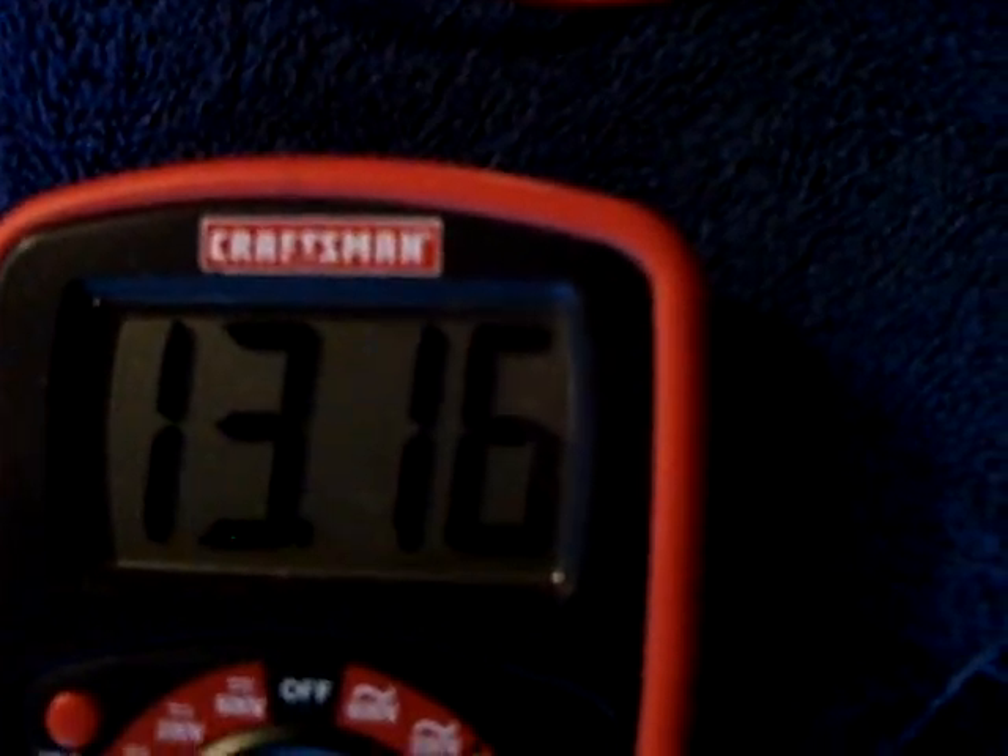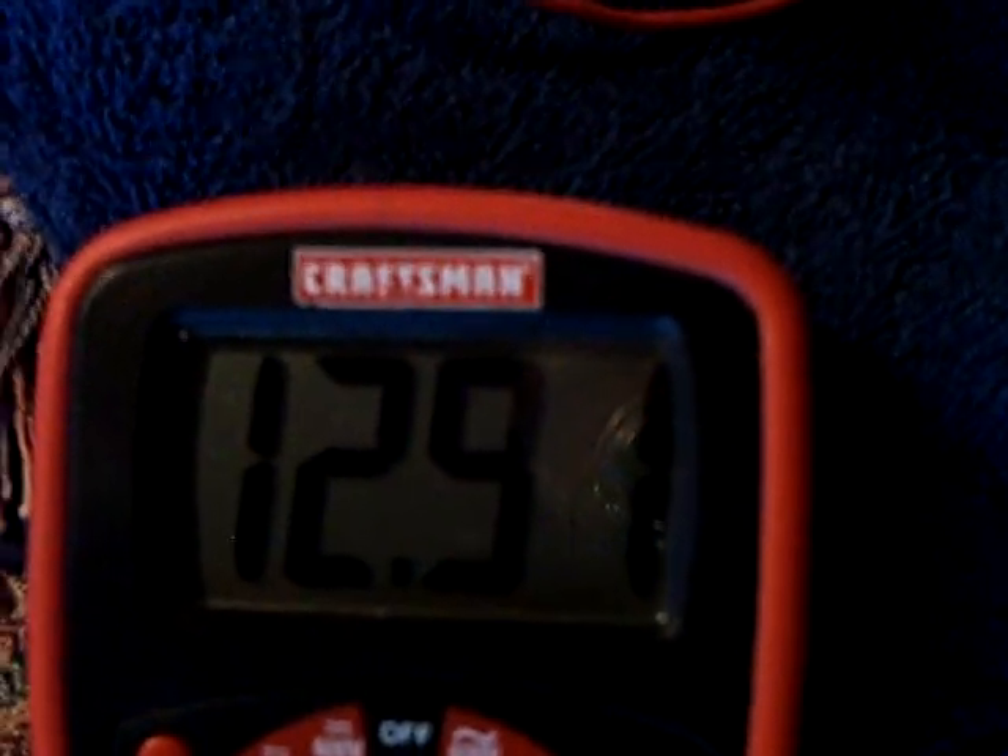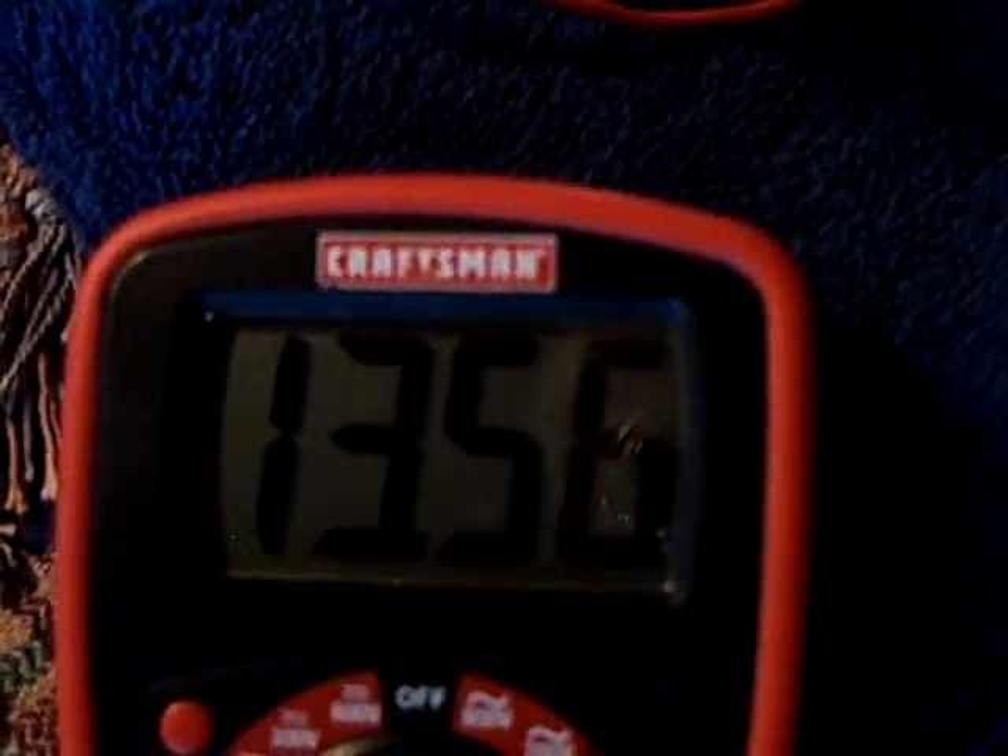There's my bright light, and I've got great charging going on too. Watch this cap build now when I disconnect from the battery — it goes right on up. So you have to be careful not to burn stuff up when you're driving it hard. But if you want the bright light, it's there. You've got great charging, and the amp draw is still not horrible — it's 220 milliamps, which isn't bad at 11 volts.